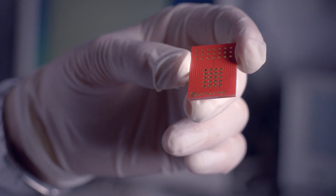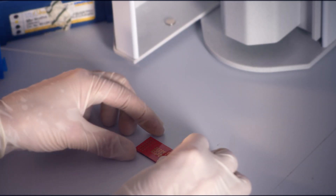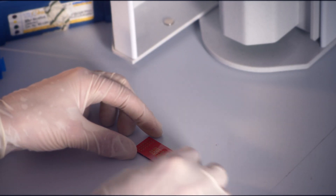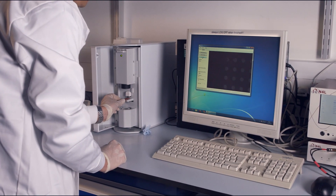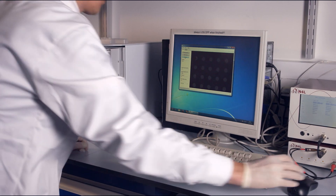Now, the most common electrode structure on these were interdigitated electrodes, where you've got two interlocking combs, not touching but just interlocking. If you take these flat electrodes and roll them up, you end up with a cylinder with electrode rings around the outside. We came up with a cost-effective way of manufacturing electrodes exactly like that. We build a little chip that has 20 of these cylinders on one little chip, so we can do 20 experiments in parallel. Also, these electrodes don't need to be micro-fabricated in clean rooms anymore and can be built at a much lower cost than traditional micro-fabricated electrodes.